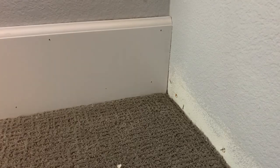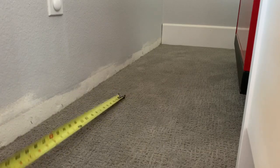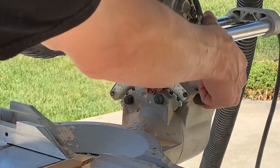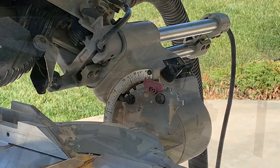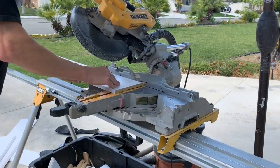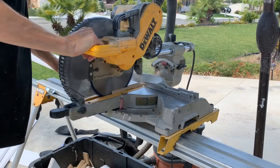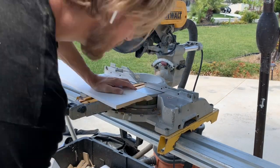There's just one piece left to do in here with two zero degree cuts butting into the wall. Take your tape measure and butt it into the piece on the left side, then check the right side — it looks like it's about 122, so you do 122 and an eighth, remember to add an eighth of an inch. We repeat what we did on the first inside cut: do a 45 degree bevel starting with the right side, make your cut, then switch it back to zero degrees, cut off some of that excess, break it off, and take the rest off with the angle grinder.